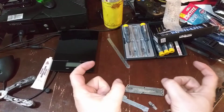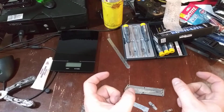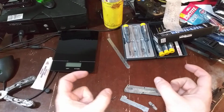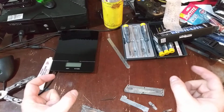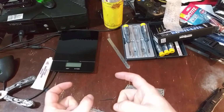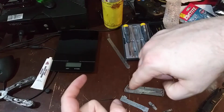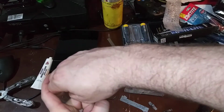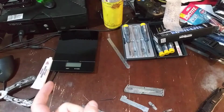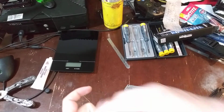And I don't know if it's because of the tension. Basically, when we pull the blade, when we want the blade out, the front hook and slide comes out, and the back hook stays, building spring tension. And then eventually the back lock is disengaged, and then all at once, the blade flies out. But just before it locks into position, it smacks into the front hook and applies just a tiny amount of pressure, so that there's a tiny bit of spring tension, and that keeps the knife from being sloppy.